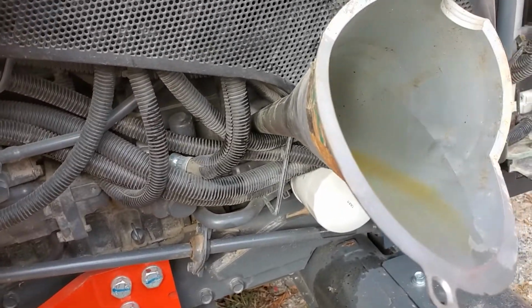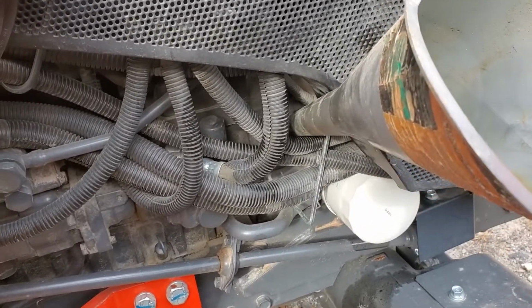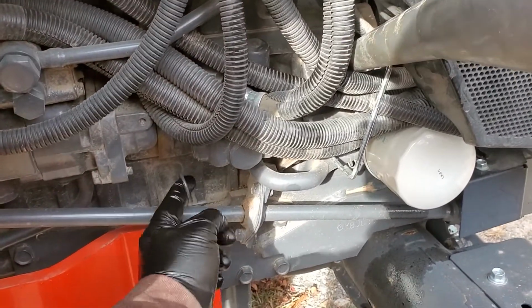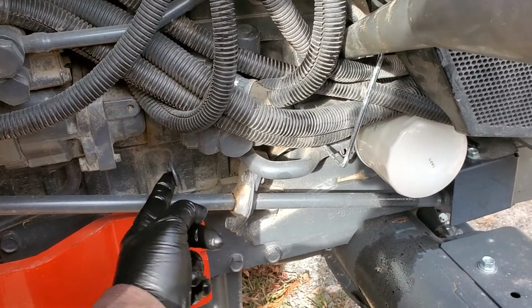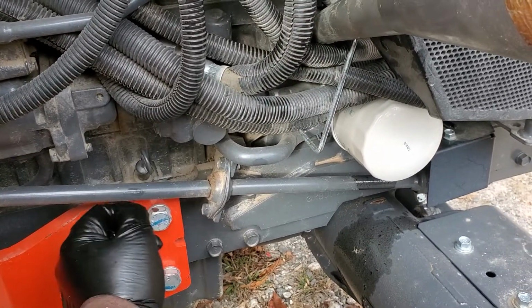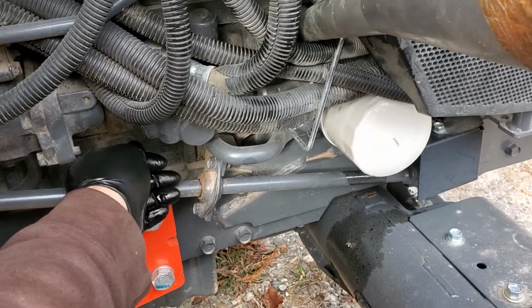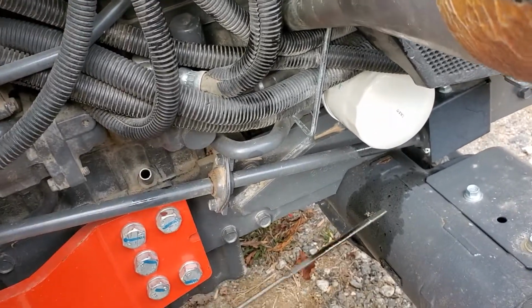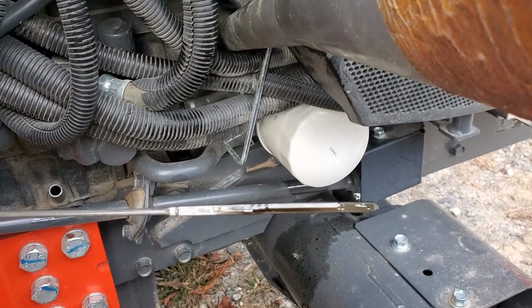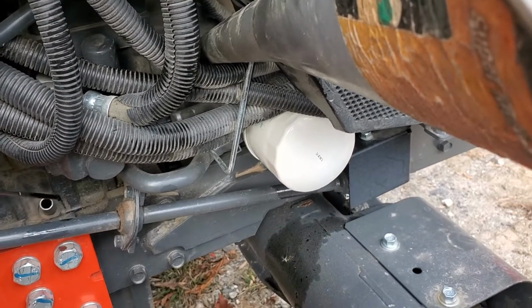All right, we're very close to the 7.4 quarts. I'm stopping a little bit short. I like to check ahead of time. Now, I've already pulled this out once, because as you're usually filling oil, you may get more on the dipstick, however that's designed, and most vehicles are like that, but I'm going to go ahead and pull this out. I've wiped it once. We'll see it again. We are 1/2 to 3/4 between the two lines there.